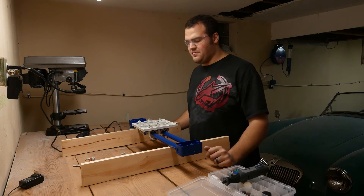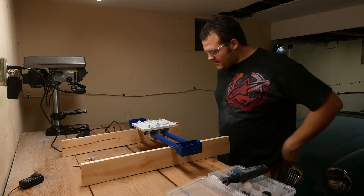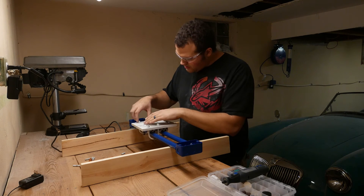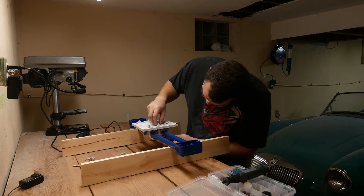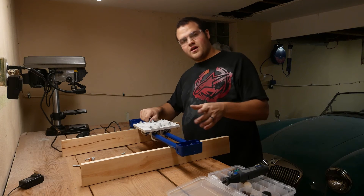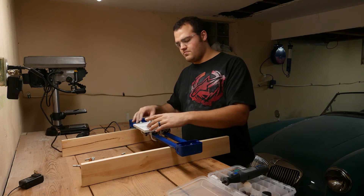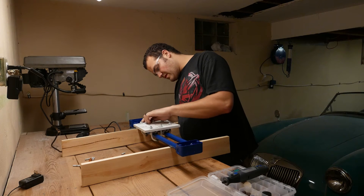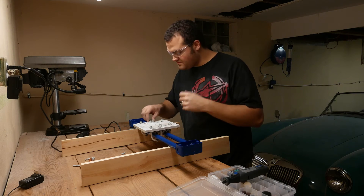Look at my great paint job. Okay, it's still there. Now that that's been assessed — cutting these bolts with the Dremel heated up the hot glue and has made some of these decently loose, much looser than they were originally. So my hot glue is basically pointless. My advice to you guys: find where you need to cut them, cut them, then jam nut everything in place. Honestly, just jam nut them from the get-go. Just go ahead and jam nut them and have that be that.